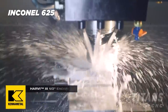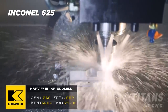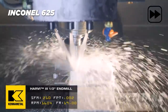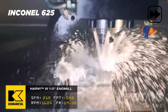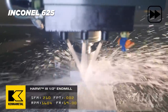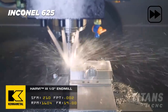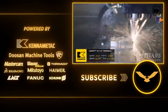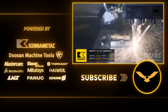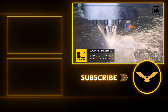When I say tool management, I mean you can actually put five tools up in the spindle — the exact same tools. Maybe tool one is a ceramic cutter, but tools 45, 46, 47, 48 are also ceramic cutters and they've been zeroed out. You basically say, 'I'm going to run this at 15 minutes,' and then the program knows at 15 minutes to take this one out. You can still use it later, but go grab 45 or 46 and run it as tool one so that you run nonstop. That's what I mean by tool management.